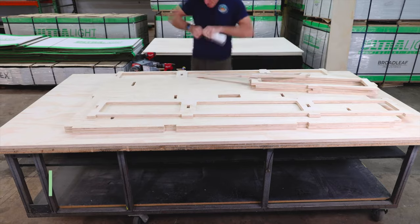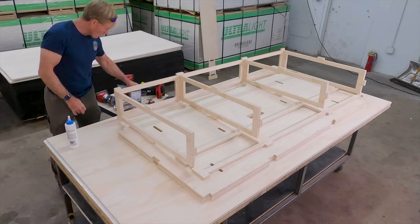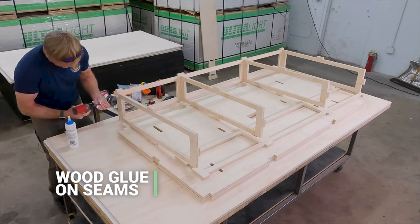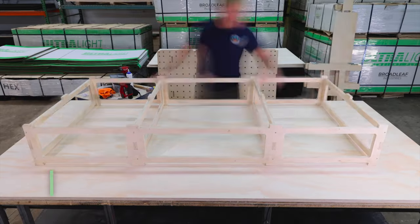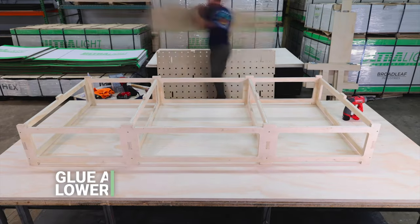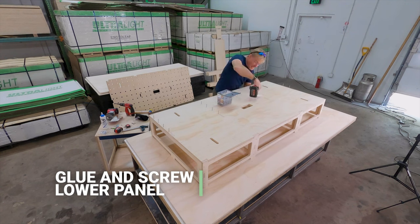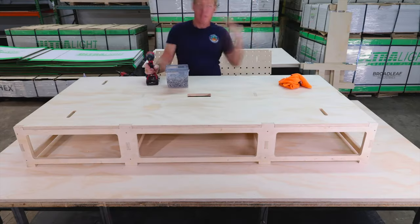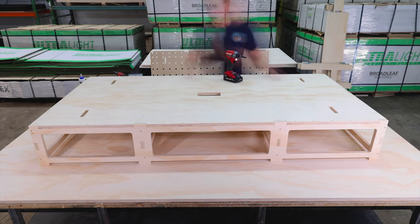The top and the bottom you can wait till you're assembled — you're going to run around the outside and break that edge — but then the most important thing is the bench dog holes. You want to do inside of each of those holes. It's just a very slight amount, but it works with those bench dogs that have the little bevel on them so they drop in below the surface for attaching all of the accessories and fixtures that work with the Palk Smart Bench.